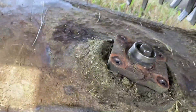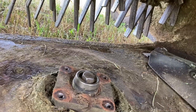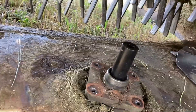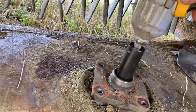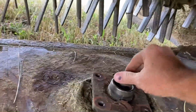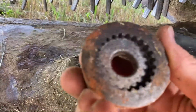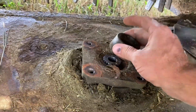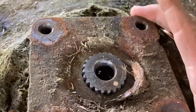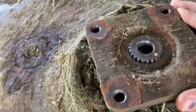That's what it looks like, and this is the actual shear hub right here. We'll pop that center one off. There's a little cap that comes off — that just locks everything together. This is the actual shear hub. There are a couple of teeth on it, and they're designed to not have all the teeth so that it will shear. But this one has jumped over the teeth.